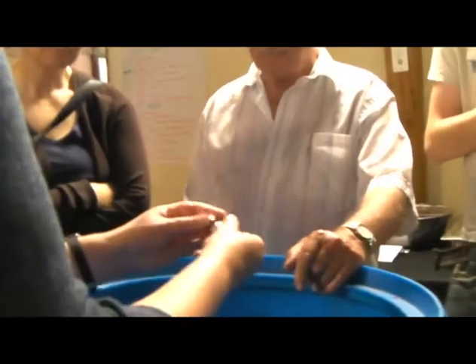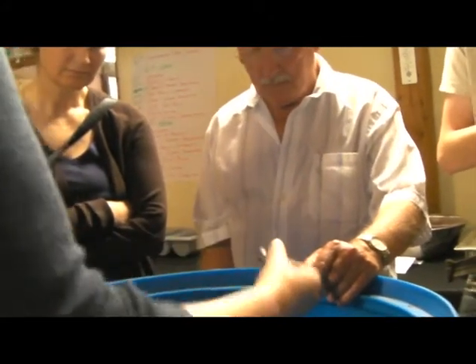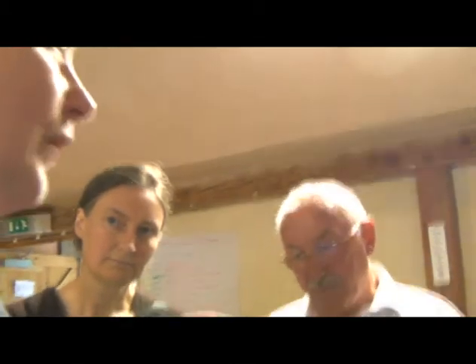So we got this to take off earlier on — it should have washers at either side. This is a tank fitting for the tank. That goes on the inside and that goes on the top there. When you screw that in, you make a hole that's big enough to screw that in. But when you get it through to the other side, you need to wrap PTFE tape to actually make sure it's tight when you screw this bit on. Make sure you're winding in the direction that you're screwing as well, because otherwise it just all bunches up. Then it should be gas-tight.